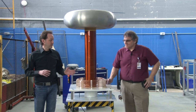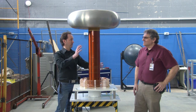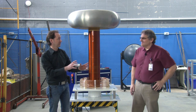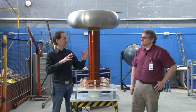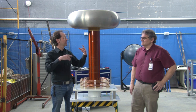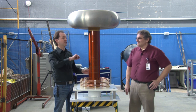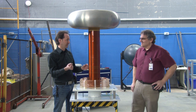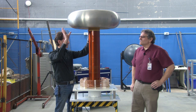So we did a test. We took it up to full power and got racing arcs, bad, all over — and there are going to be some really pretty stills from that. Then we swapped out toroids, retuned, did another test, and racing arcs went away. Mostly — I had to crank it up to full power and hold it there for 30 seconds to do it. So that cured the racing arcs, because now we have a totally differently shaped field.